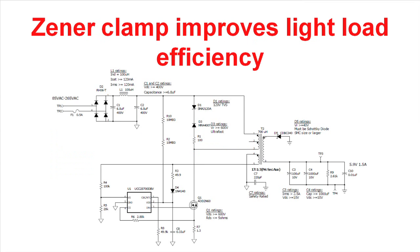This is the schematic of an adapter that you might see. We have a universal input voltage, 85 to 265V. It gets rectified and filtered, and then it's applied to the flyback power stage. Traditionally, you'll see an RCD snubber used at the drain of the MOSFET to limit the voltage. In this case, we have a different snubber configuration. We're going to put a resistor in series with the diode, in series with the Zener diode. The Zener diode will provide most of the clamping in the circuit, and it will only dissipate power when need be. It's different from the RCD clamp in that with the RCD clamp, there's always power being dissipated in the resistor.